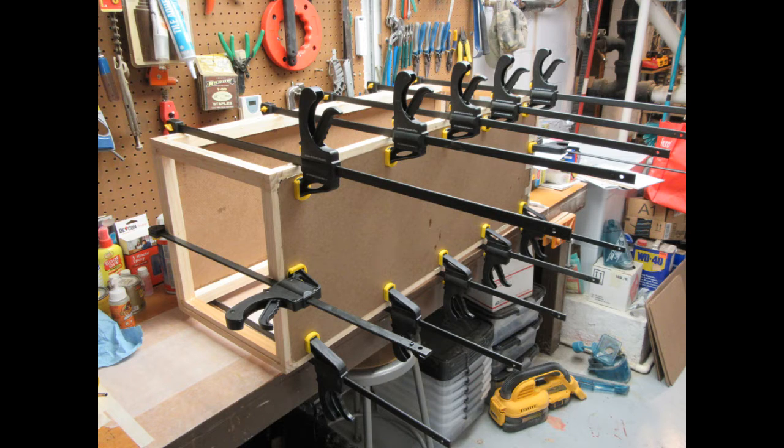inlay areas. It is imperative that the pads of the clamps can reach and press only on the masonite panels and not on the frame, and that the pressure is only applied where the frame can back up the pressure, so that the masonite panels are not bowed inwards. Pressure must be applied every 8 inches or so to prevent the masonite flexing out of the inlay.